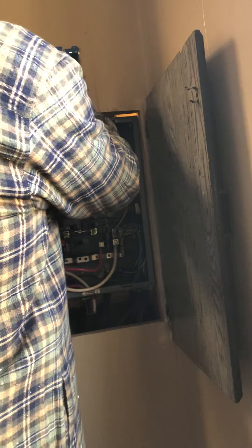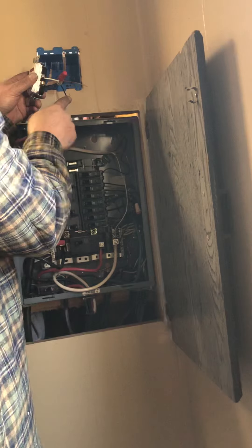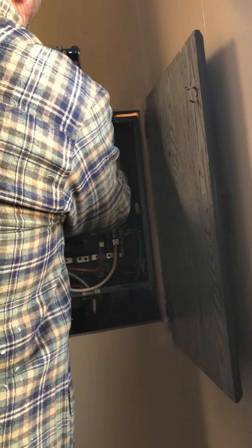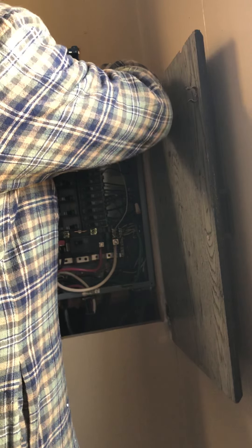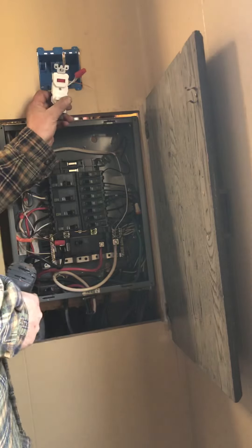When you put your J bend in the wire, you always put it in the direction of the rotation of the screw. And I always pinch them. That way when you're tightening the screw, you're actually helping to keep the wire on the screw. Just in case you guys didn't know this — I never know who's watching this.